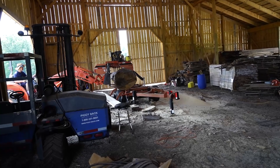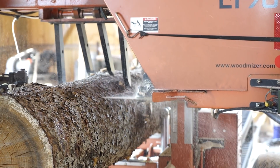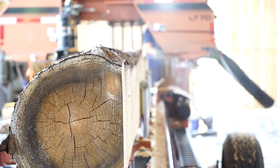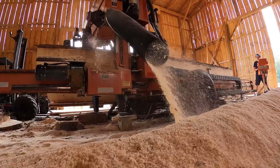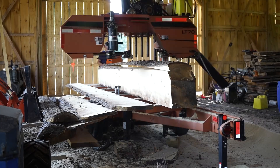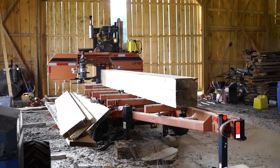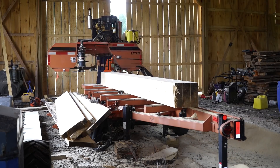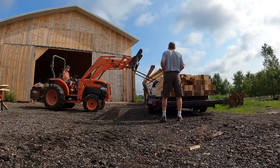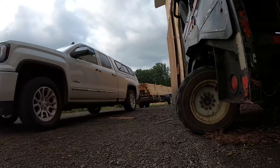The first thing we're going to do is head over to a local sawmill and get the timbers I need. I'm using spruce because it's what the sawyer had on hand and based on its structural characteristics, it's a perfectly suitable species. Eastern white pine and Douglas fir are probably the two most common species depending on your geographical location, and white spruce is very similar to eastern white pine. There's years of research, engineering charts that lay out the structural characteristics of different wood species and required sizes and allowable spans for the loads they'll experience.